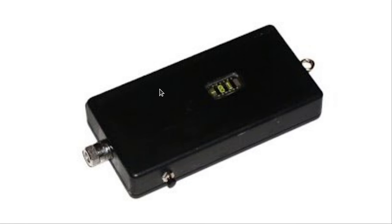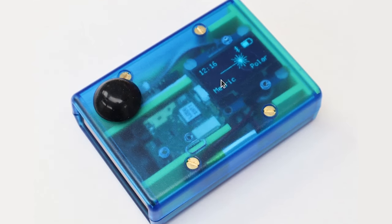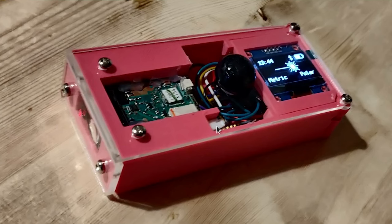After a few years I got some competitors and they had a laser rangefinder, so I needed to redesign everything. It's still quite hard to find off-the-shelf laser rangefinder modules which work in the visible spectrum — there are lots of infrared ones but finding a visible one is quite a challenge. You'll notice the case is now transparent so I don't need to cut a window in it. We've got a much more ruggedized button and a nice OLED display which makes it much easier to display information. This was all quite tightly packed together, so after a while I moved on to a 3D printed case — still all the same components inside, just a bit more spaced out and actually the same circuit board underneath.